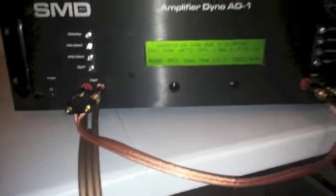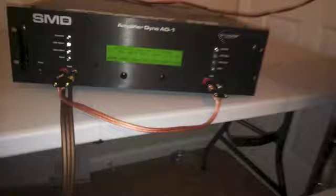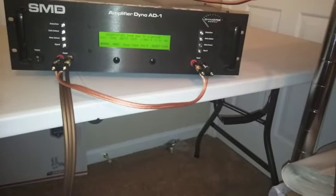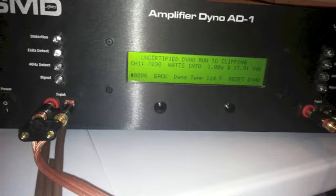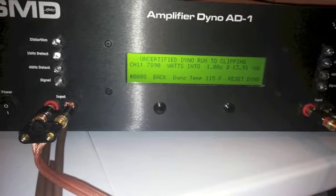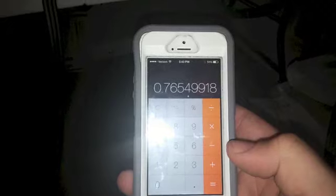All right, we just saw 741 amps right when I hit pause. This makes a lot more sense. 741. And we have 7,890 watts at 13.91. All right, these numbers make a little more sense for us. We got 741 by 13.91. On paper, if you take volt amps, this would be 10,307 watts. But we know that's not true, so we're going to take our reading here of 7890 divided by 10,307. And we find out at 1-ohm, this B2 M1S has an efficiency of just over 76%.